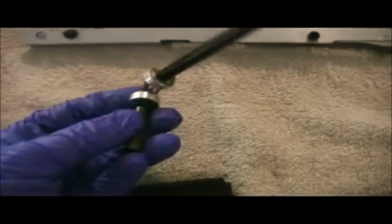This rail system was actually really difficult for me to make. I tried a couple different things. I tried using a solid copper tube, and bending it at a right angle, and that didn't work because the inside diameter was too small for the BB to go through. And I tried surgical tubing, which was the perfect size for the BBs, but the BBs would get clogged up, I'm guessing because the surgical tube would bend and create a clog kind of thing.